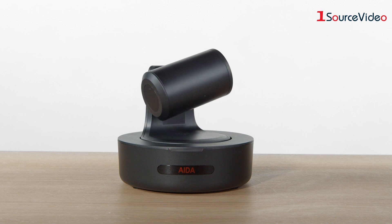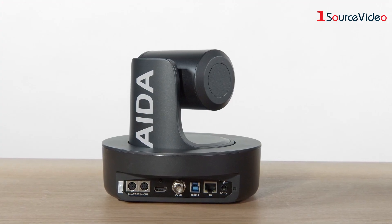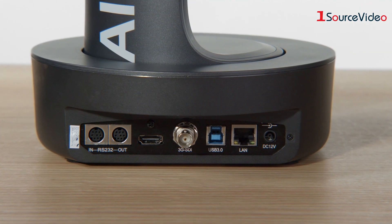The camera can be powered by multiple methods. We can use a 12-volt power supply, or very importantly for some people, we can use PoE. We can connect just a single Ethernet cable which contains the power, control, and video. Being an IP camera, it can both be controlled by IP, but it can also output signals like RTSP, giving it a wide range of connectivity.